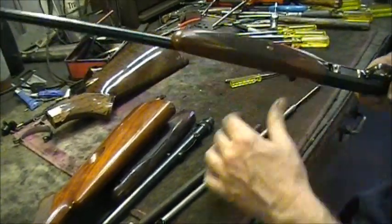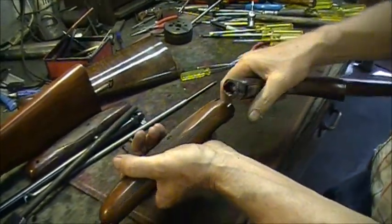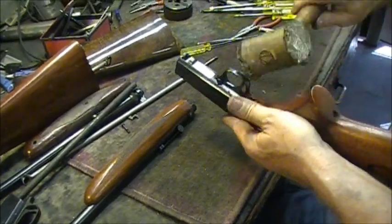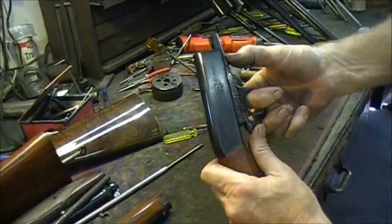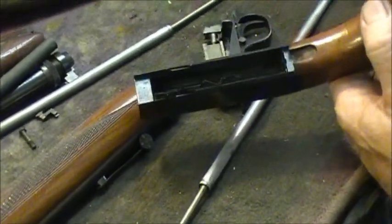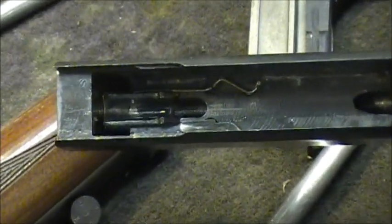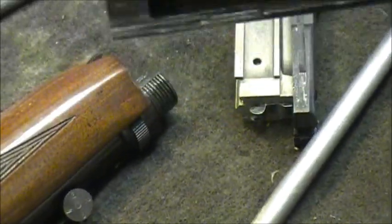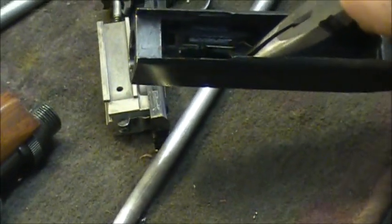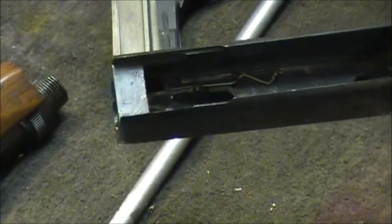This little short gun has some differences — it shoots shorts only. The stock may stick a little; you may have to shock it loose with a rawhide mallet. In the short model, the cartridge guide is shorter and squattier. Always be careful of your little cartridge stop, because in most cases it'll just drop right out. Don't lose that part — it's not expensive but it's an inconvenience.